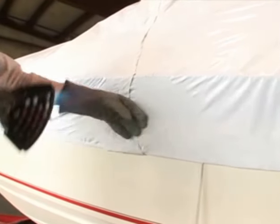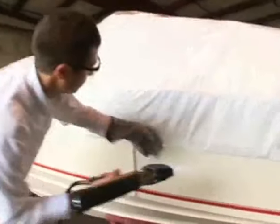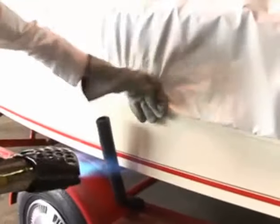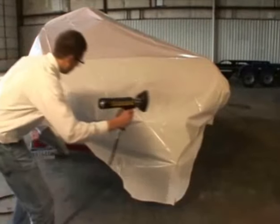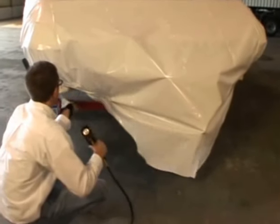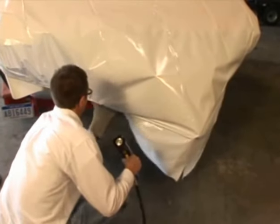As you come to a pleat, do the pleats at the same time as you go around the boat, so when you are done going around you are ready to begin shrinking the cover. You can shoot heat into the pleats and pat them shut with the back of your hand, making sure you are wearing your glove. The heat will be horizontal just above the perimeter band — this is a beautiful use of the shrink fast heat tool, and it goes very quickly. This is why you only want two or three inches of material tucked in above the perimeter band. Brian is finishing up now and both sides of the boat have been heat welded around the perimeter band.